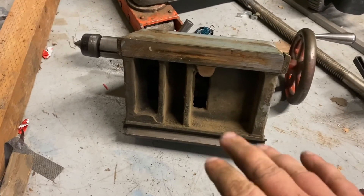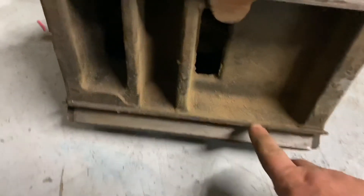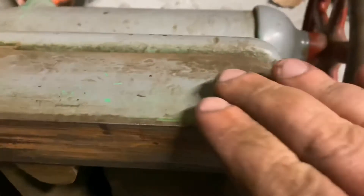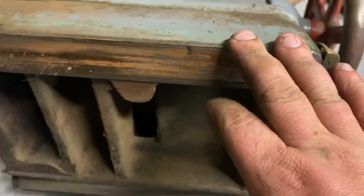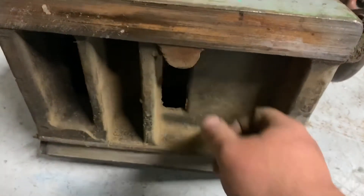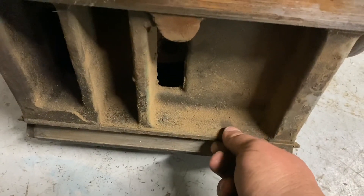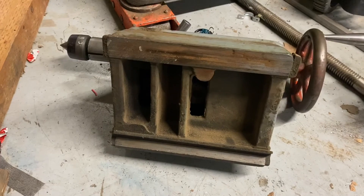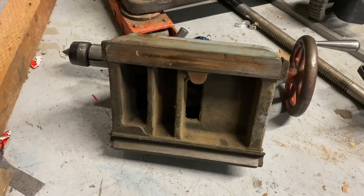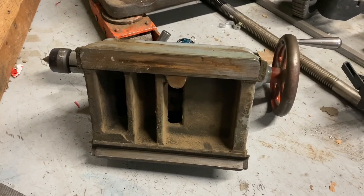The only thing I'm worried about is we're a lot thicker on this side of the V flange than the back. As we go up — because this is slightly tapered — we're going to lose some outside dimension. So I'd rather shift it a little bit this way because we have plenty of bearing surface here, and it just gets thicker and thicker going up. So yeah, that's the plan — very encouraging, very optimistic. Okay, that's today's quick little video. This is Adam from Small Town Machine Shop — please comment, like, and subscribe. Thanks for watching.